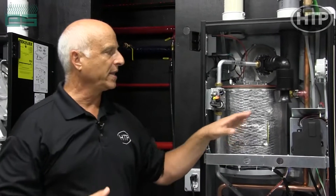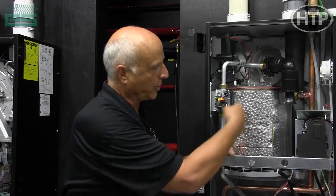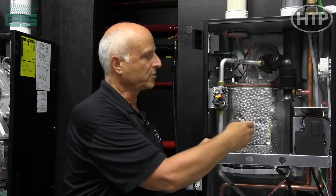The real key to the design of a fire tube is it has very low pressure drop, because your hydraulic circuit is through the heat exchanger where it is wide open.